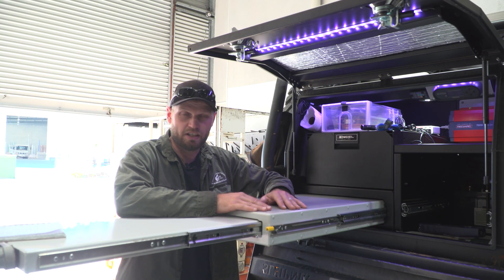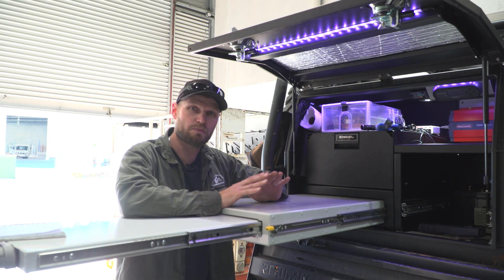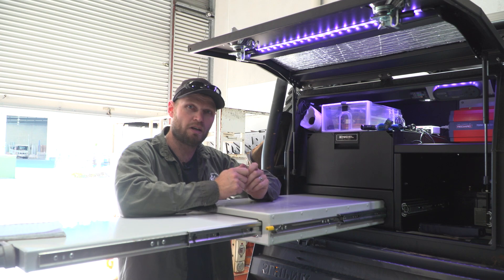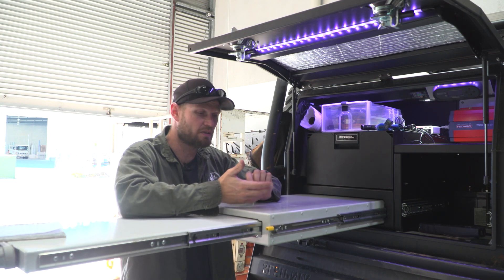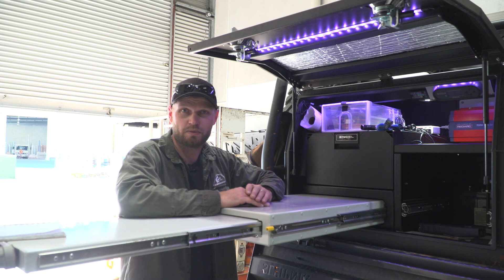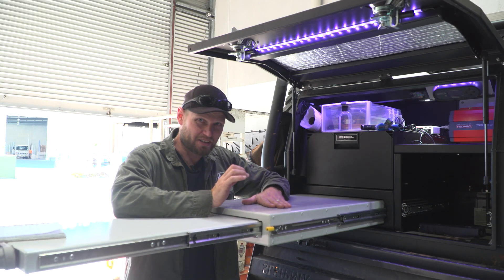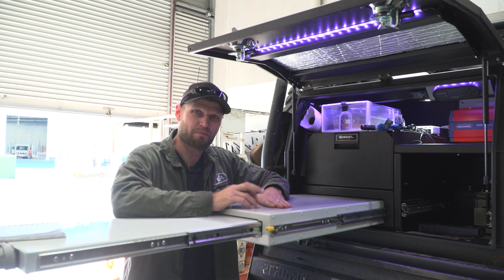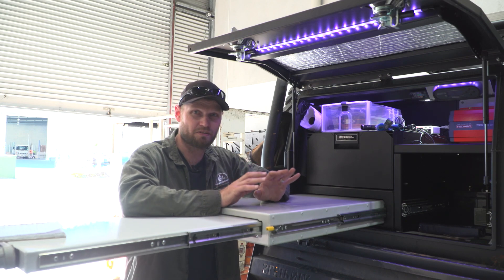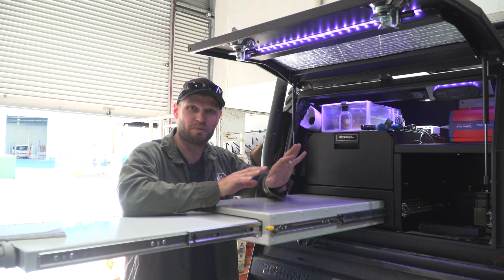The panel is probably the main thing. If I could redo it, I would have worked out placement first and had the panel cut in half — easier to work with — and had all holes pre-laser cut or plasma cut. I had to cut every single hole myself, which is a delicate procedure. I highly recommend putting masking tape over the panel so you can edge into it carefully, draw on it, and mark it without scratching the panel itself.